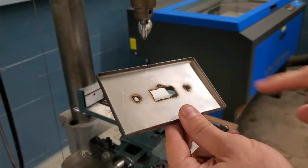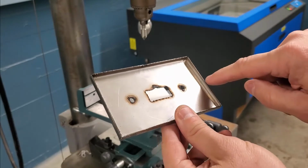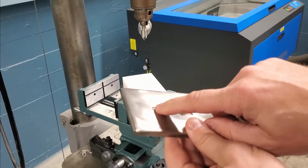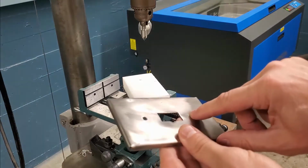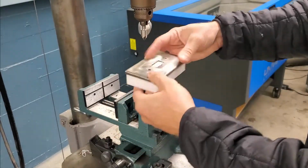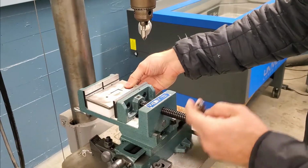All right, so once you've made your 4 bends here with the pan, box, and brake, the next thing you want to do is to drill some countersink holes right here where we're going to screw in our bolts. So to do this, go ahead and grab this white piece of plastic here and place it on top of it and place it into the drill press vise here.